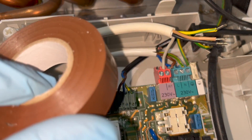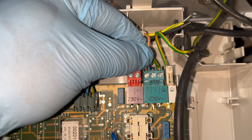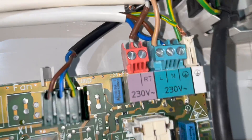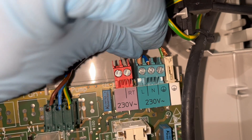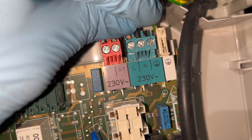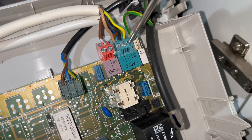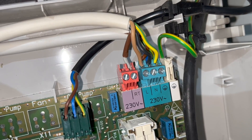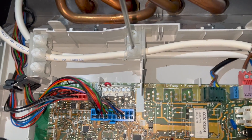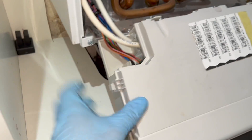RT is all done. Put some brown tape around the gray cable to show that it's going to be live, as it is our switch cable. Put the brown cable in with the existing brown cable and tighten it up — give it a pull to make sure it's not going anywhere. Do the same with the black cable into neutral and tighten up. Then the last one at the boiler is the earth. Now that everything inside the boiler is done — switch cable, live, neutral, earth — tighten the clamps to make sure the cable doesn't move. Put the PCB case back on, shut the panel, and put the case back on the boiler.